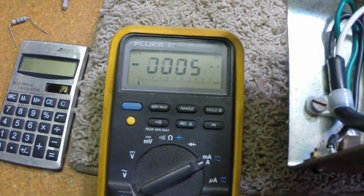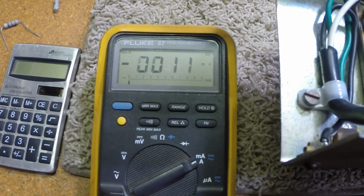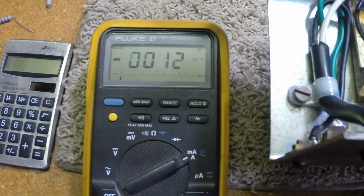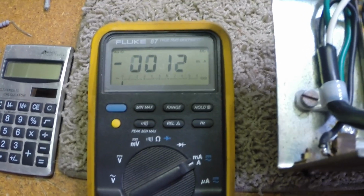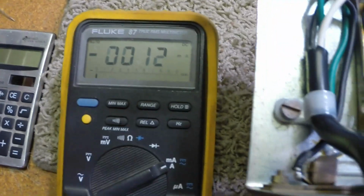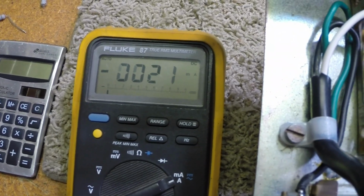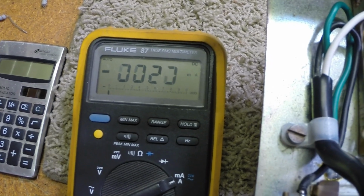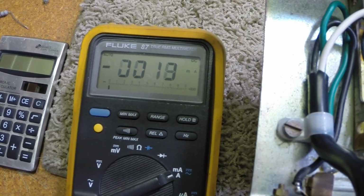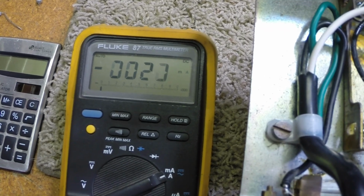So let's bring the signal up. There I'm at my 12, which is maximum dissipation on the tubes. And that is, hang on, that's about halfway up on the volume. There's full out. So we're less than half. Well, so we're full up. We're not quite double screen dissipation max.